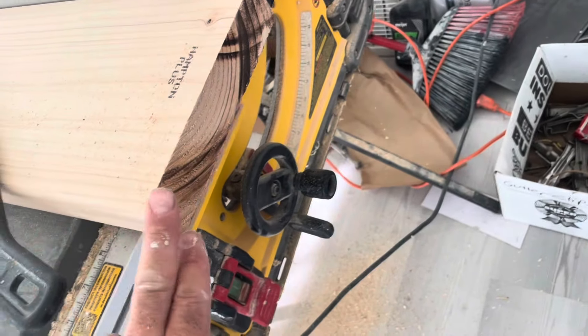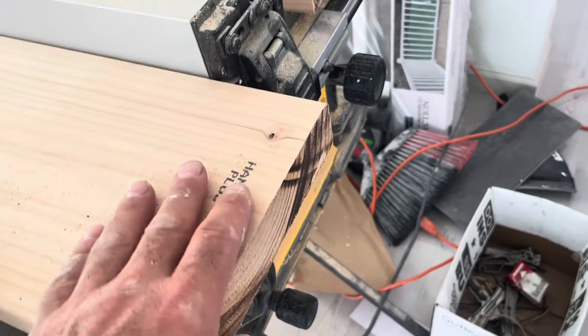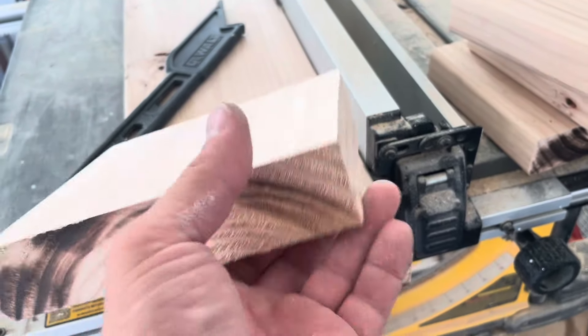All you're doing is buying — if you want 8 inches in length — a 2 by 10 by 8, 10 feet long, 12 feet long, whatever you want. See what I'm doing is ripping off the edge right here. See what's going on — just taking off just a little bit to square it off. You got a solid piece of wood.